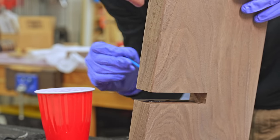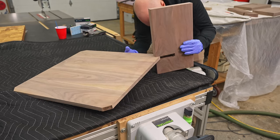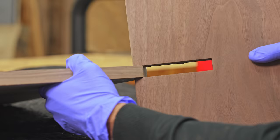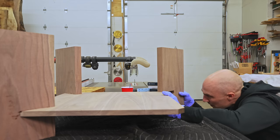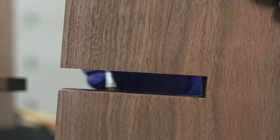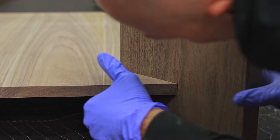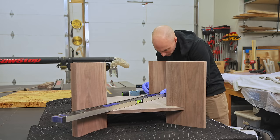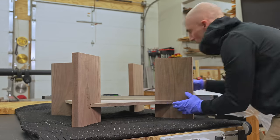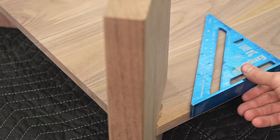This type of furniture is almost good enough to be held together with friction only. However, if someone kicked it or hit it with a vacuum, it would jar it out of that 45-degree position, so I'm opting for just a little bit of epoxy. I didn't want a bunch of squeeze-out — just a tiny bit is going to hold it very securely. I didn't put any on top either because I didn't want it to flow down over the sides, since epoxy is a real pain when it oozes all over the place. I got them all situated exactly where they needed to be, got my long level out to make sure they flowed nicely from one side to the other, then double-checked it with my 45-degree carpenter's square to ensure a nice 45-degree angle.